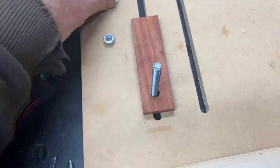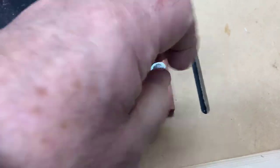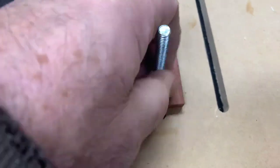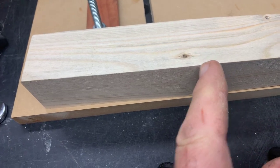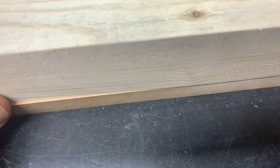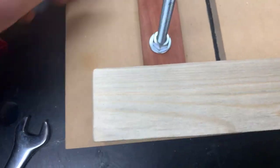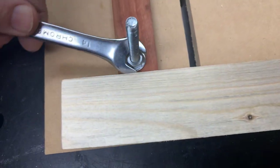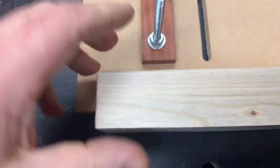Table legs like this will probably be around 50 millimetres max, going down to — well, I've got 20 mil, and I think that's probably as thin as you want to do it. So I quickly pop this up, put the timber on here, find the point, and mark down to about 150 millimetres — that's the point I want to sit right there, where it starts cutting. As you see, it cuts down the line and stays parallel, so it's just a matter of pushing it over until it hits your timber where you're happy with it, then you lock it down.